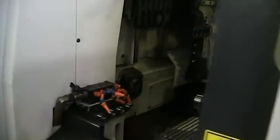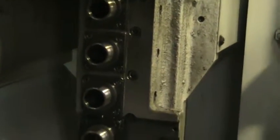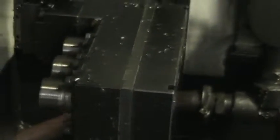Let's run the live tools first. We're going to run this at 4000 RPM. There will always be a little noisier with no collets and tools in the unit. This has got a five position live cross drill. They also have a 90 degree face live tool with three live tools on it. You can remove the bottom piece and add another cross drill in there.